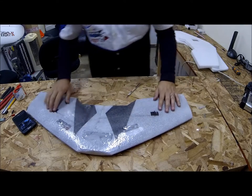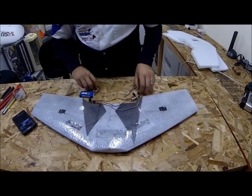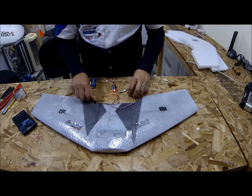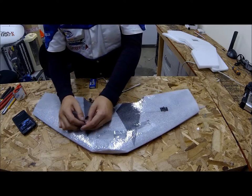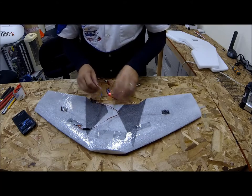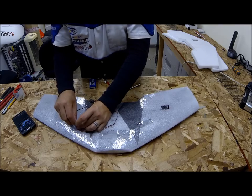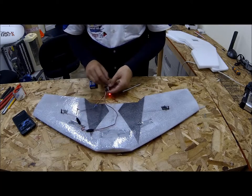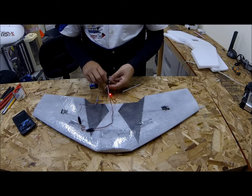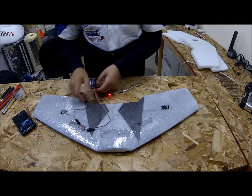So that's out. Now that you've got these all opened up, take your little BEC here, center your servos and plug them in — servo comes alive, centered. Let's get the next servo in. Servo comes alive and looks like right there is about centered. So I've got my servos now all set up, no binding, no catching on anything. So that's good.